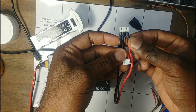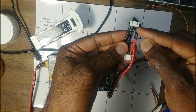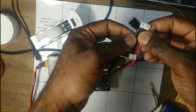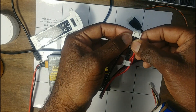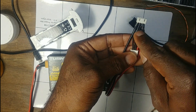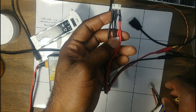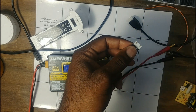I took a banana connector, twisted it with the wire on the outside of the red, and soldered it to that pin. Over here I took the black lead, connected it with the cable on the end, and soldered it to that pin. Then I just soldered the two middle pins straight through.